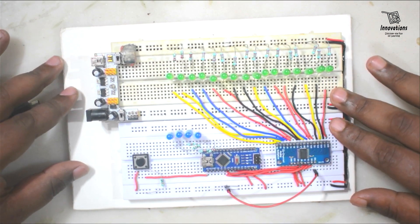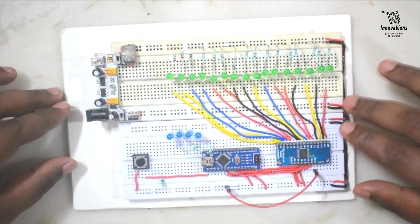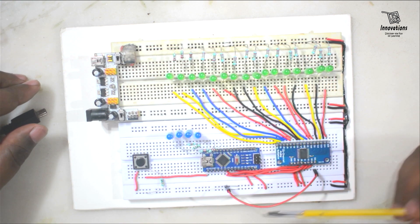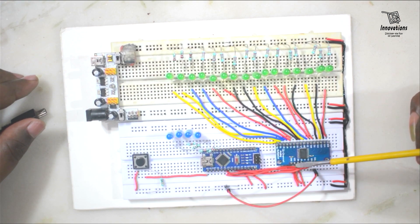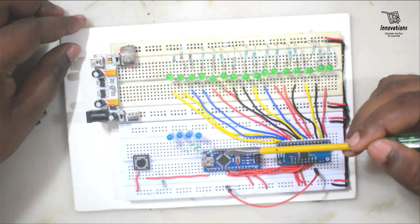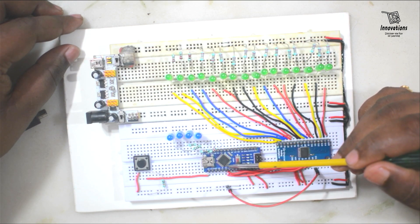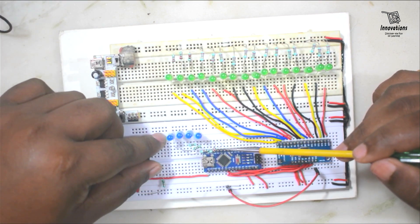I will give the circuit diagram as a download link in the description box so you can download it and build it yourself. I have connected the 16 pins of this module to LEDs, and the LEDs are connected to the negative power supply via 220 ohm resistors. The signal pin is connected to the positive power supply. The S0 to S3 pins are connected to analog A2 to A5 pins of the Arduino Nano used as digital outputs. VCC is connected to positive, and both enable and ground are connected to the negative power supply. I have used D9 to D12 pins as binary output to display the selector pin status with separate LEDs.